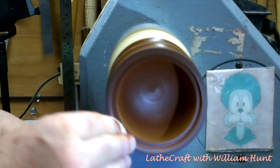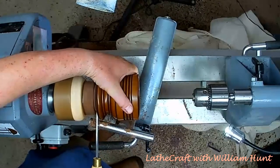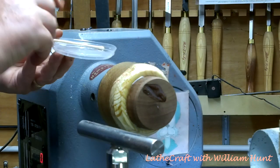The colour match using the two colours — burnt orange and honey over the top — has worked extremely well. I'm now going to sand this back a little bit, add some sanding sealer, then some black embellishing wax to try and make it look more like the outside. Having completed that process, it's now time to part it off and turn my attention to the lid.